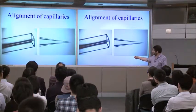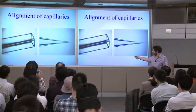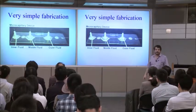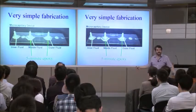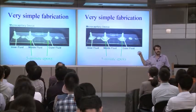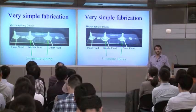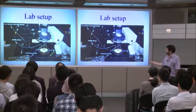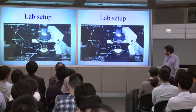So this is what it looks like. Here's the square capillary. You can buy these now — they're commercial. Little round capillary where you put them together, you line them up, you build the device like this. Remember, we like simplicity in the lab. It's all held together with just five-minute epoxy. Someone as skilled as Anderson can make a device like this in half an hour, really. And he can teach people how to make it in a few hours — we teach everybody how to make these. This is the way it looked in the lab, connected with some pumps. We look in a microscope, and it works really well.